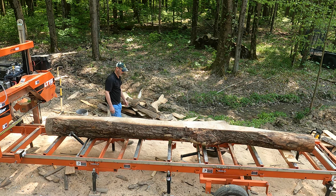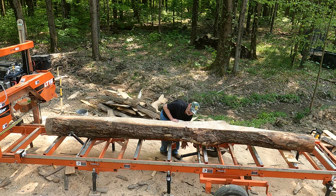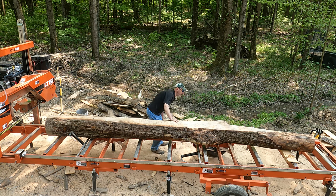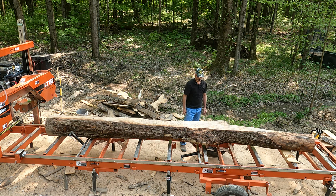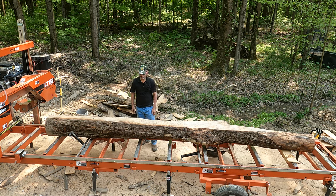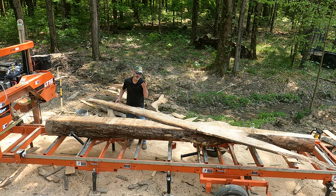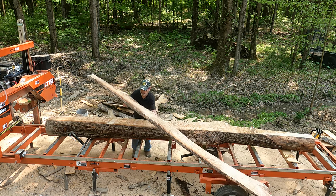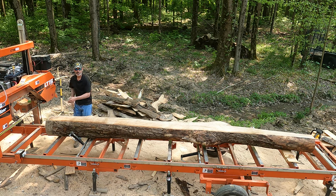The problem I'm running into is right here in the middle. The bottom of the log is really high. In fact, it's about 4 inches off the bunks. So there's no way I'm getting 8 inches this way. So I'm gonna have to try and go widthwise, and I don't know how that's gonna work. I guess we'll just put it on the ground for now. You're using the forks, so. It's good and flat.